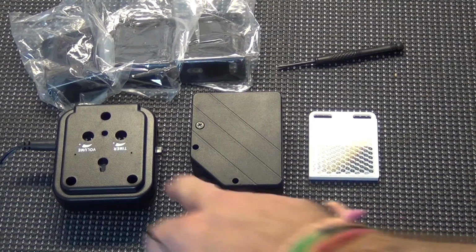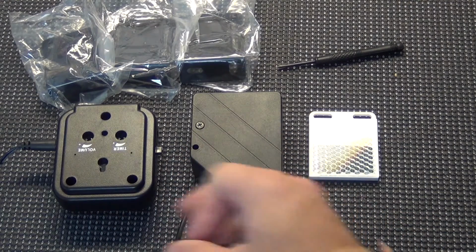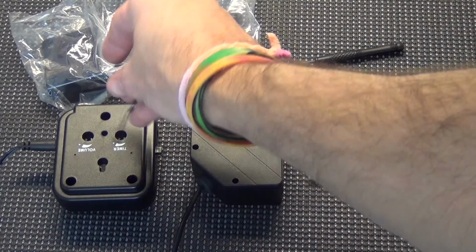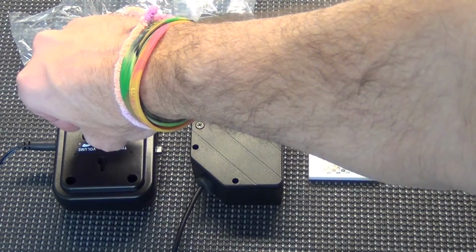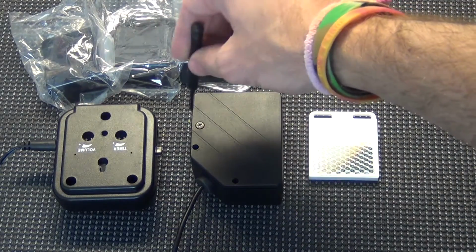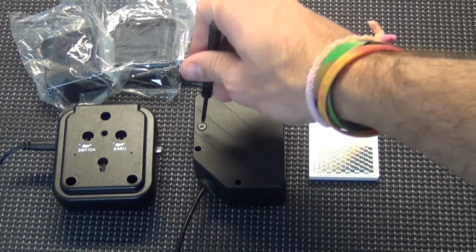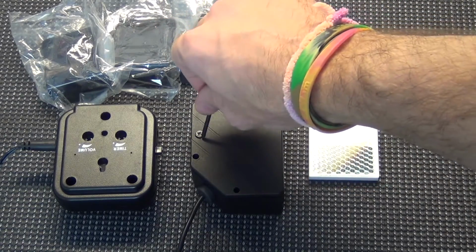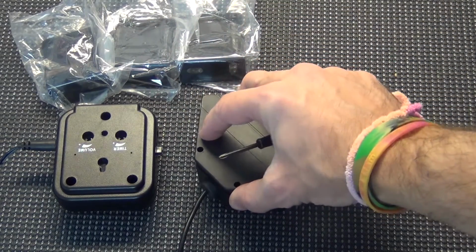You'll flip the speaker over, which I've got on its back already, and in the middle between a timer and a volume, there's a little hole, and you'll take a paper clip or a tie or something, and press that button. You'll unscrew this little screw here on the photo beam, and what we are doing is pairing the two together.